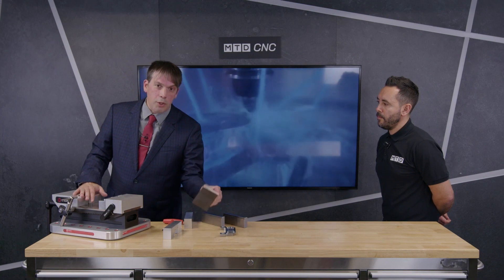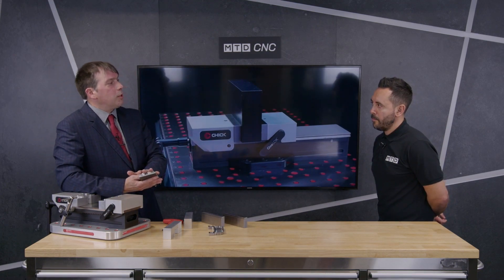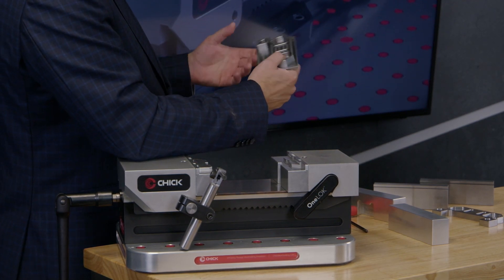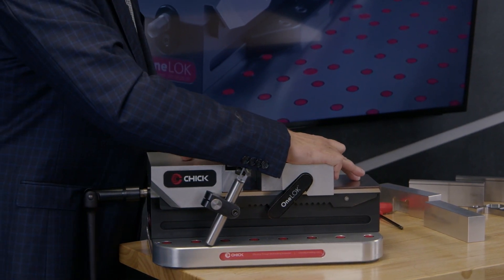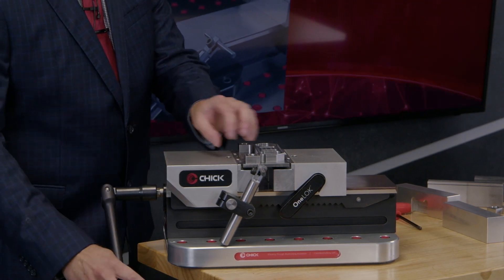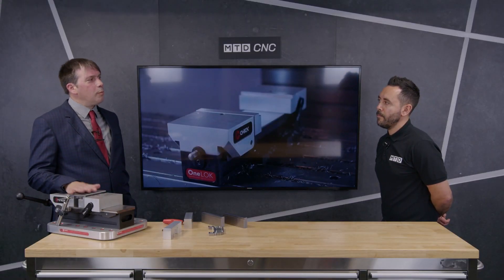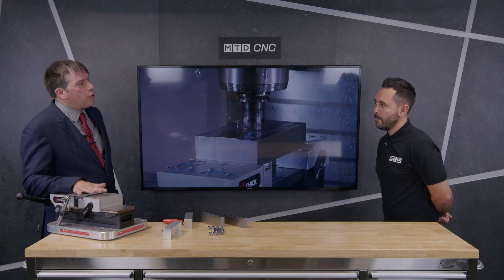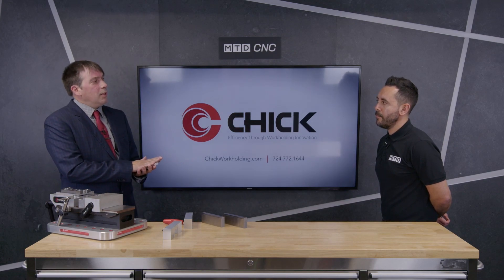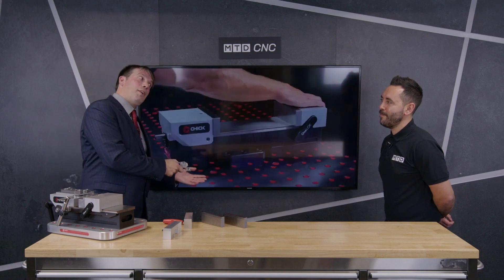This set of jaws has been machined to clamp this workpiece. It's a two-op job — that's our first op, and this is our second op. A lot of the time, people would run a whole batch through the first op before even looking at the second op. So if you had a batch of 100 of these, it's going to be 101 cycles before you get your first finished part out. If you use a set of machinable jaws, I can clamp my raw material for the first operation using the built-in work stop to locate it, and then have a second step in the soft jaws to clamp it for the second operation. After my second cycle, I get my first finished part out, which can be a huge advantage. And there's also a big advantage when you get to look at your finished workpiece and make sure the work done in the first op is correctly aligned to the second op — and you haven't only found out after 100 cycles that you need to run the whole lot through the first operation again, which I've actually seen happen.